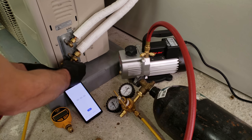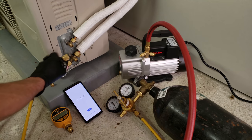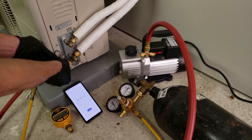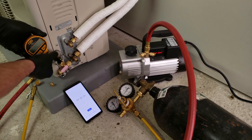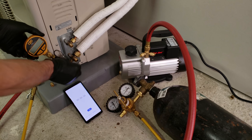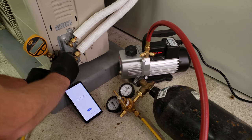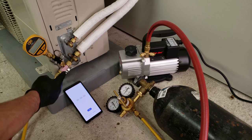I like to keep the valve core removal tool to the side. We're pulling the valve core out to reduce restriction here — we want good flow for our vacuum. Now we're installing our 5/16th valve core removal tool. These valve core removal tools typically have a valve core in the side port; I always pull that out and leave it out. I use valve core removal tools to reinsert the valve core when done. A second one is installed just to valve off my vacuum gauge. This hose connects to our vacuum pump — it's a 3/8 port with a 3/8 hose that reduces down to quarter inch.